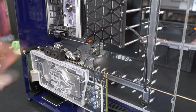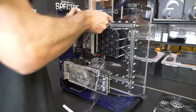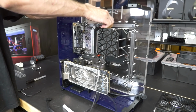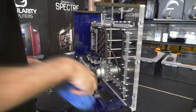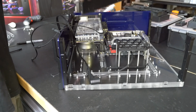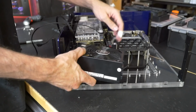And normally, with the pressed steel cases, they're only 0.6 of a millimeter thick or something. So there's all this flex in the case, and PCB components don't have very good tolerances, but it's normally not such a problem. But with the strength of our cases, if a PCB component is slightly off anywhere and things don't line up, the case is not going to flex at all. So we actually have to build tolerances into our cases to allow for bad tolerances of all of the manufacturers' components.